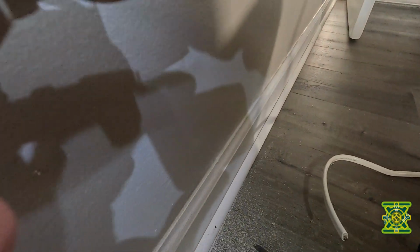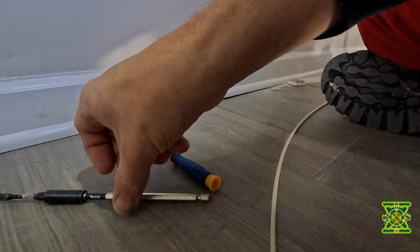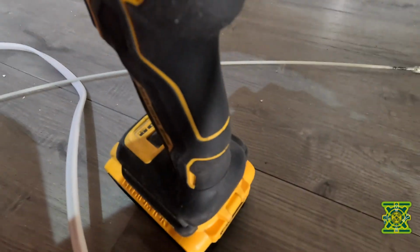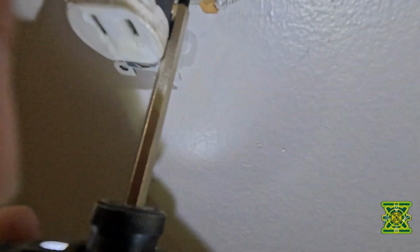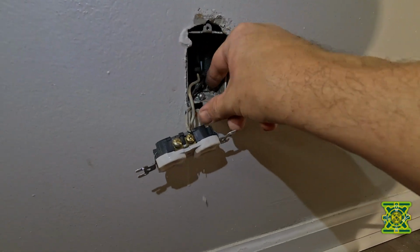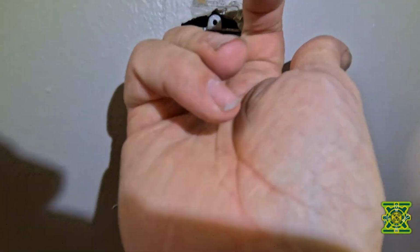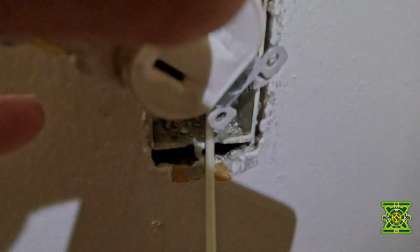Lift these up and run the new line onto that one, and we have to get that bracket out of there so that I can run this fishing line up, get that wire down here. Here we go. Dropped it down. All right. What we want to do next is push that wire up. So we're going to have some room to bring that fishing line up. All right, there's the fishing line going up the hole. We're going to be looking for it at the top.